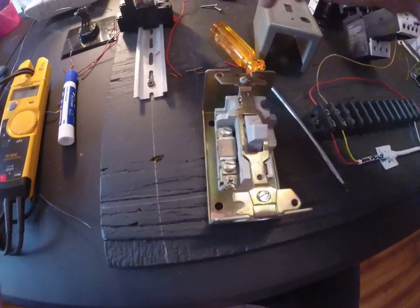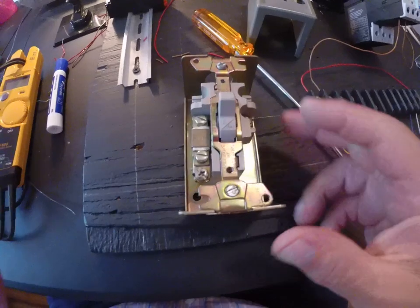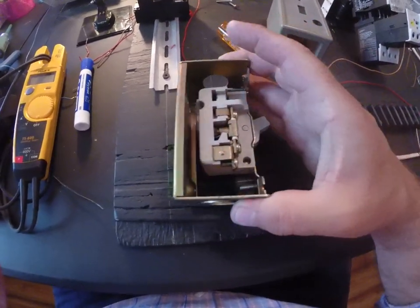The first feature is obviously the on-off switch. So we know manual motor starters, you have to have a man to start it up. So you got to be there to start this thing up, and I could use this as a form of disconnect and I could use it also to provide overload protection.